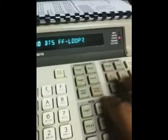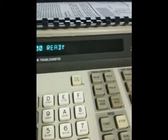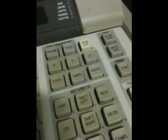I'm going to hit stop. The problem is: why is the RAM not working right? What I found was that the write enable line on the RAM seemed to be stuck high. I have an HP logic comparator connected to the 74LS32 that provides the write enable line for the RAM. It's turned on right now but not showing any problem because the RAM is not being accessed.